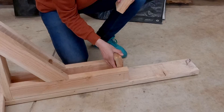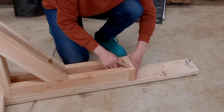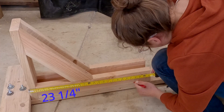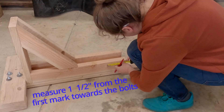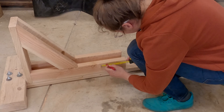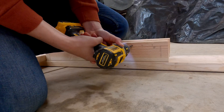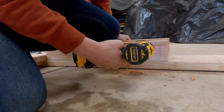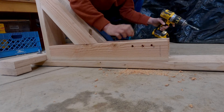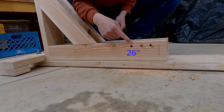There are a couple of ways to do the tire stop. Number one is taking that last 6-inch 2x4 and screwing it onto the end, then adding a free-floating wooden piece or two depending on your tire size. The second way is more elegant: measure 23 and a quarter inches from the end beam and mark a hole, then measure and mark one and a half inches and repeat. Mark and drill out these holes on both sides and make sure the bolt fits smoothly through. These correspond to your 29-inch, 27.5, and 26-inch wheel sizes.